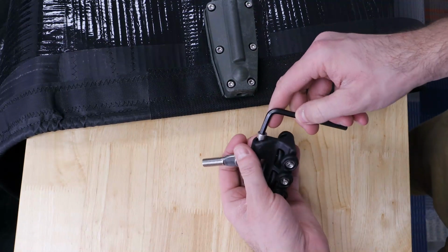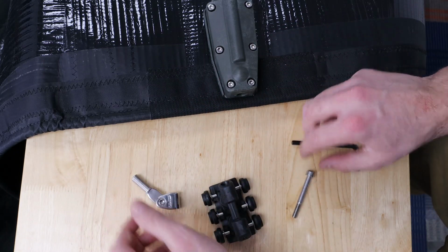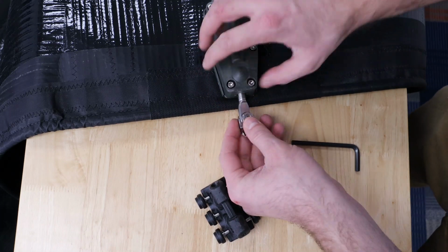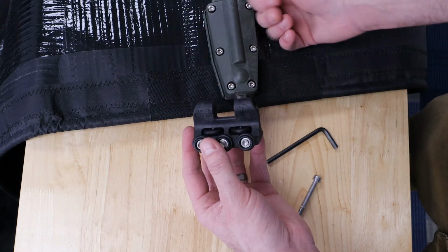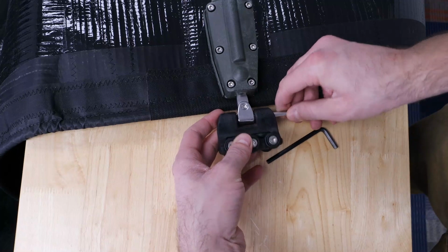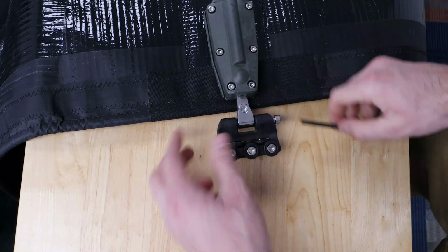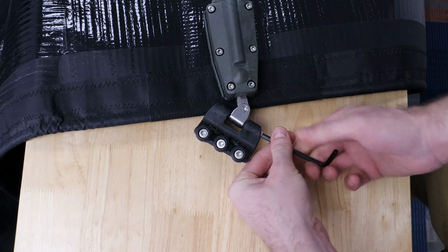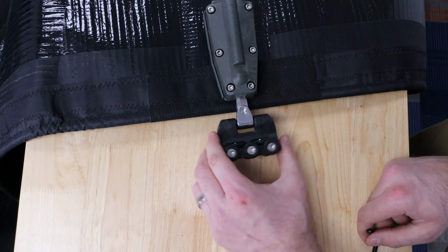What we recommend you do, if you have the time, is to remove the pin, take the pin that came with the receptacle, and install it like this. Take your receptacle, make sure that it's pointed up towards the head of the sail, slide it over, reinsert your pin, and tighten it down. There you have it.